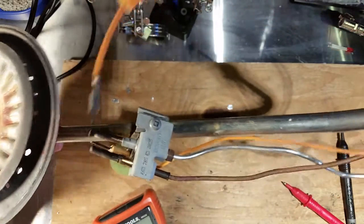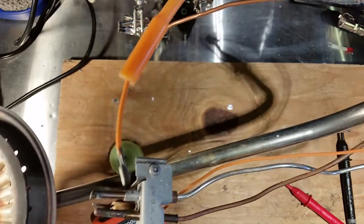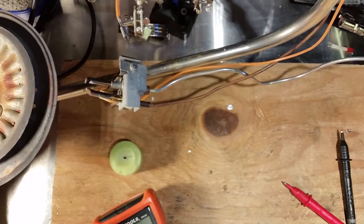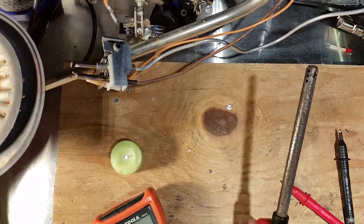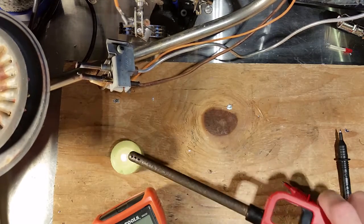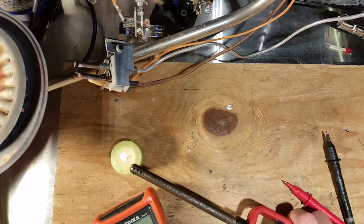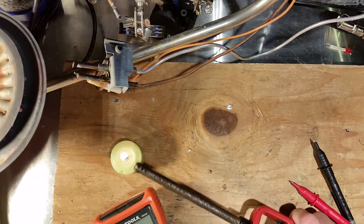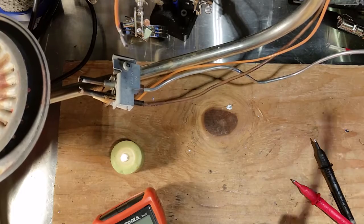To light the burner, if you could imagine that this little candle, en français une bougie, is our pilot light, whenever I introduce gas, I'm not going to spark it, it ignites. So if this was our burner, we leave our little pilot light lit, and anytime I introduce gas, it lights up. So it's the same basic principle for this.